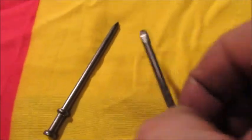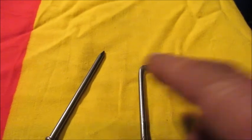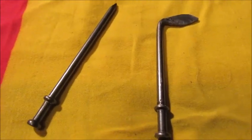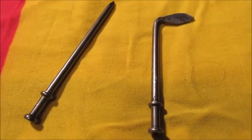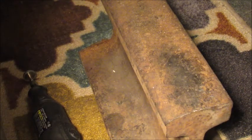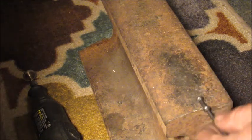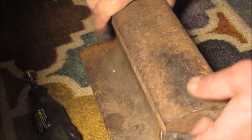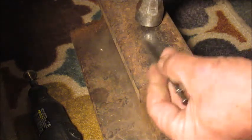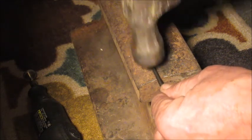The nail will end up being your raw form. To get it like that, you don't bend the nail at first. I've got a small anvil from a piece of train track — it's a railroad rail I keep here in my room. That makes it pretty easy to do this. This end is going to be your handle, and this end is going to be your axe head. The best way to do the axe head is not to flatten it out all the way, but to get it started.